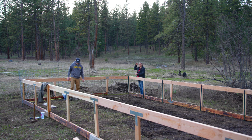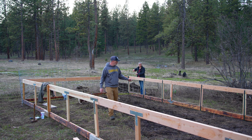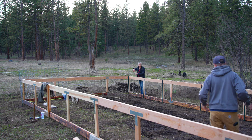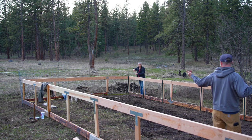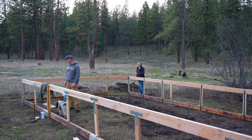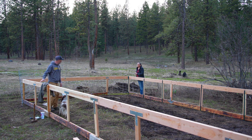Well, without counting the back wall and the front wall, I think it should match your centers. So one, two, three, that'd be four. You do one on each end because it needs support on the ends. Yeah, okay. And then that'll support the edges. Gotcha. Because that's the only other place that I've seen them fall apart. The weak points are on the edge. Yeah. So then it'll be connected three ways at the top.